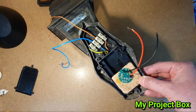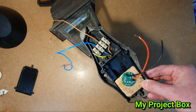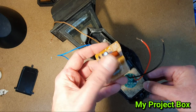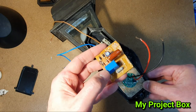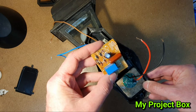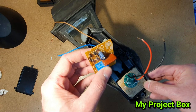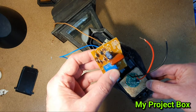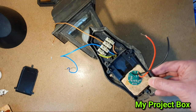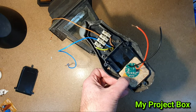I don't think it was worth repairing the original - this is a better solution, especially to drive LED bulbs. In some cases the relay consumes more than half the power the LED bulb would use - you have this elaborate circuit just to power a mains-contact relay, and it wastes energy just switching the bulb on. You don't want the circuit to consume almost as much as the light bulb itself - that seems silly. This will be a slightly more energy efficient way to do it.